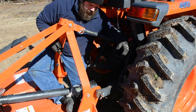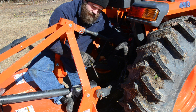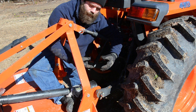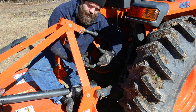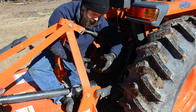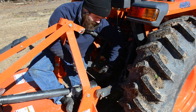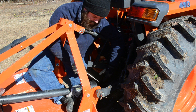I called up the tractor shop and they told me that sometimes, in the kind of situation I described, the spring mechanism on the inside that helps the bearings retract can get off kilter, or a piece of dirt can get in there and one can get stuck. Their suggestion was to try putting a screwdriver down in there to get the bearings to release so I can slide it back onto my shaft. If not, they said I'd need to bring in the front half of the drive shaft and they can replace the collar mechanism.